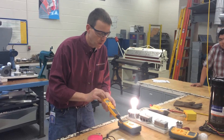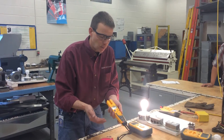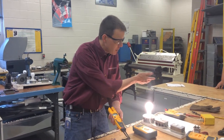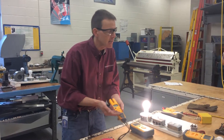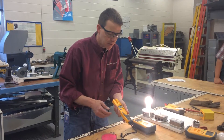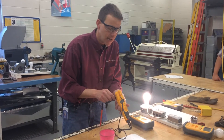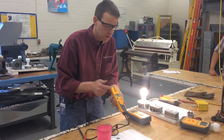The three options for this stick Fluke meter are volts, amps, and ohms. If I want volts, I just set it to V — whether it's AC or DC volts, measuring a battery or alternating current from a power source, it's going to auto-range. I don't need to set it to a high setting; it's already the highest setting. For amps, I use this fork to measure the current through the wire. I don't have any current flowing right now, so of course it reads zero.